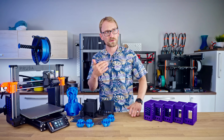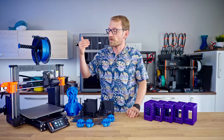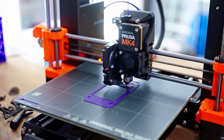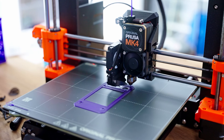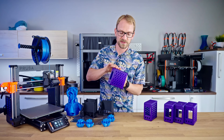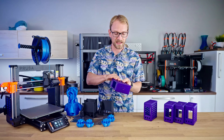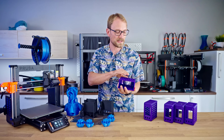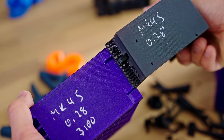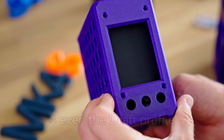There are also 0.25mm structural and speed profiles that the MK4 didn't have, so that increases the nozzle flow rate just a bit. Linear print speed stays pretty much the same, giving about a 15–20% overall print time gain from those new profiles without really losing much in print quality. You can see the coarser layers, but parts are dimensionally very accurate and aesthetically consistent. There are no artifacts from corner ringing, input shaping, or corner rounding — these are still very much tuned for dimensional and usable parts.